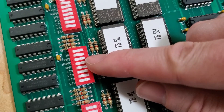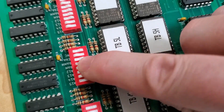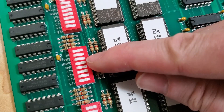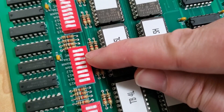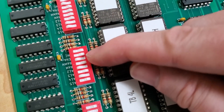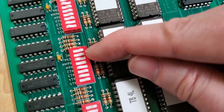If this was RAM, this setting would put the RAM starting at address 5000, and now it's set to address 5800. The next to last switch controls the overall enable setting for the bank — here the bank is turned on, and now the bank is turned off. This last switch controls nothing.